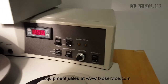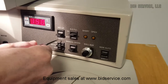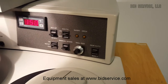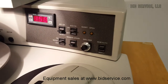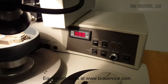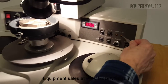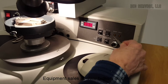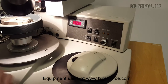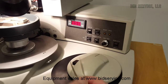Going over to the right-hand side, we have an on/off switch for your motor — that's your Z head motor. You have your reset and setup. We have an EFO, which stands for negative electronic flame-off. With the EFO on, it enables the voltage to go to your EFO wand right here. If there's any troubleshooting needed you can shut that off and continue bonding. This also has a short and open detector — if the ball is not formed because of a short or an open, it will indicate right here. We have a manual spark if you ever have to manually create a ball, and the ball size is adjusted here to determine the size of the ball that's formed.